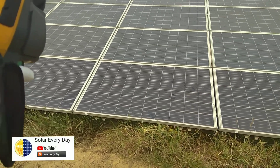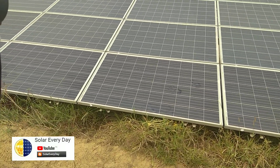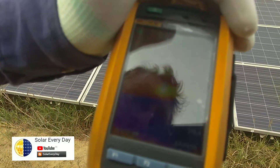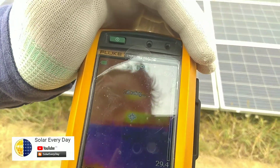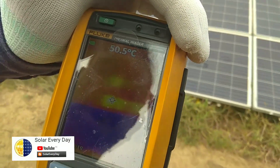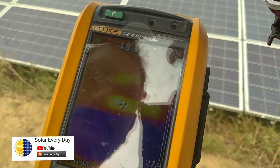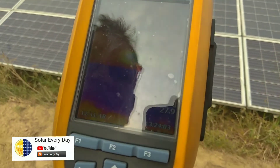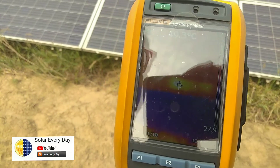On this small particular cell which was under the shadow, and the cell just above it. If you point the thermal tool here, the cell was about 51°C, now it's going down — 51, 49 — so since the shadow is removed, the temperature is going down.